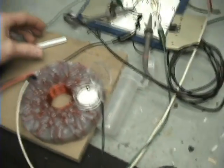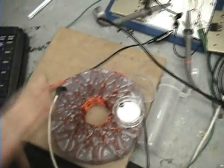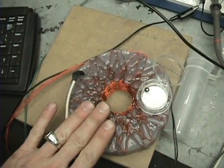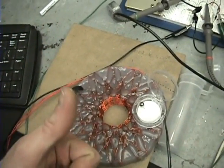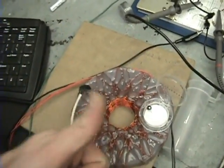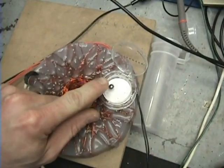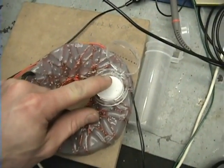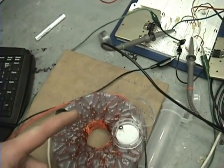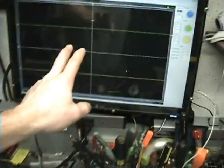Here's how the double pulse motor works. Basically you have to have two coils — one is your north coil and one is your south coil, both facing the same direction, so they're opposite polarities. What happens is the magnet turns halfway around and gets a pulse from the south side, then turns halfway around and gets a pulse from the north side. So instead of one pulse per revolution, it actually pulses twice during one revolution.